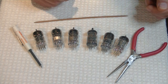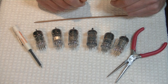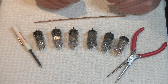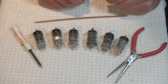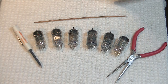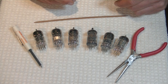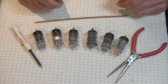Number three: you need to go through a lot of tubes to find good ones. Some don't light up — DOA, or dead on arrival. Some are very mismatched. Remember, these are twin triodes — two identical circuits inside one envelope — and in many circuits you need both sections to amplify at the same rate, or close matched as we say. And lastly, some are just noisy — in fact, many of them are noisy. They work, but who wants all that background noise? Last week I had a large order on the tester and the failure rate was 44%. In most cases the suppliers will make good on that and return 44% of the purchase price.